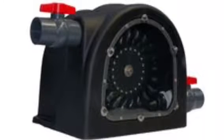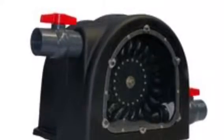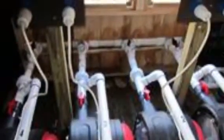I'll show you this in a second. And this is the answer to it. You are able to stack as many of these units on your stream as long as you have enough flow to power them. Each one is capable of up to, like I said, 1.6 kilowatts per unit. If you only need 1 or 2 generating, or if the stream happens to slow down in the summertime or winter, you can shut 1 or 2 units down, or you can keep adding them as you possibly need.